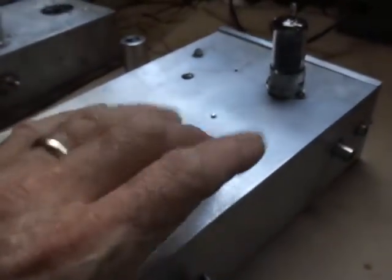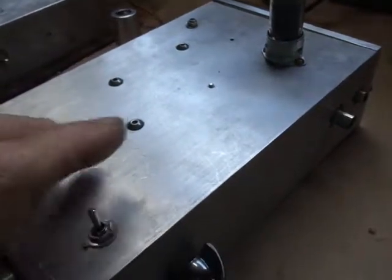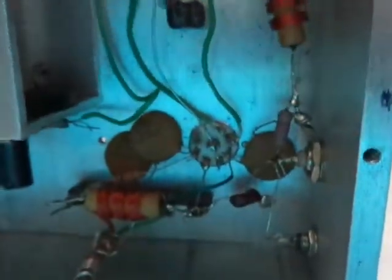I'm going to find a used aluminum chassis. This is extruded aluminum chassis - it's 5 by whatever length I needed to cut. It's got very stout material, very stable. Your VFO needs to be in a very stable fixture so things don't move. The wire went a little oversized - doesn't hurt - they have thick wire, doesn't move around.